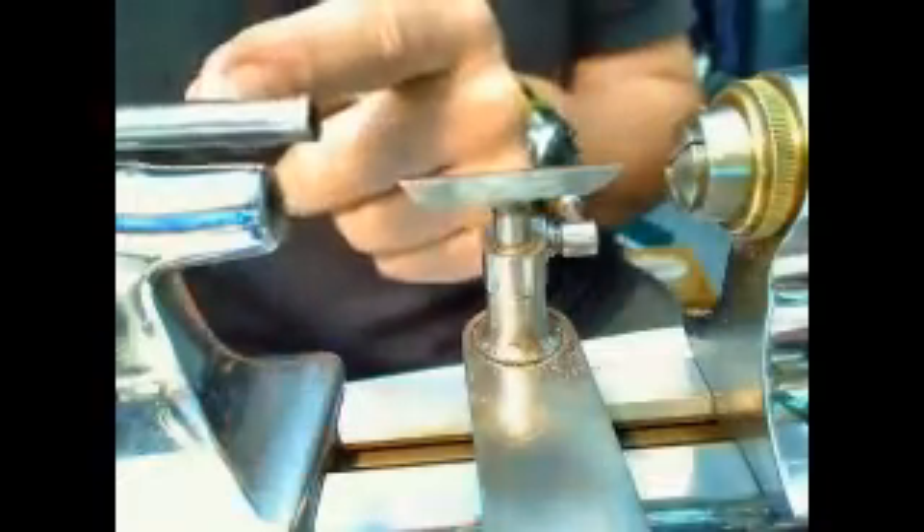It's got like, I'm not sure what the taper is because they weren't standard back in the old watchmaking days — but 3, 2.4, whatever degree taper. So what I had to do is take a piece of steel and turn it down into a taper so I had a tapered fit.